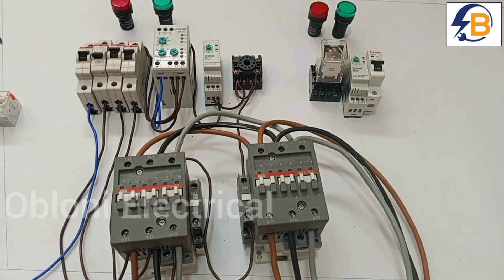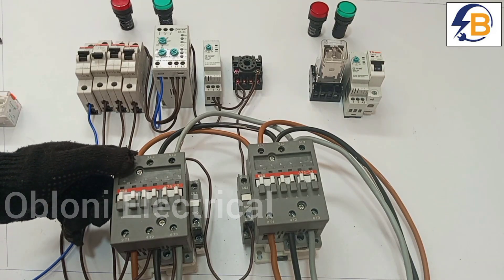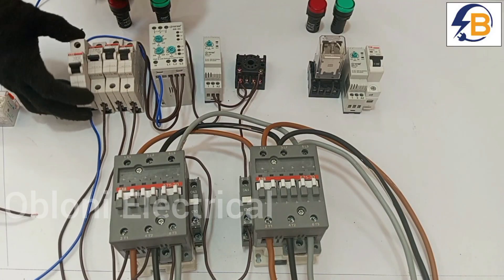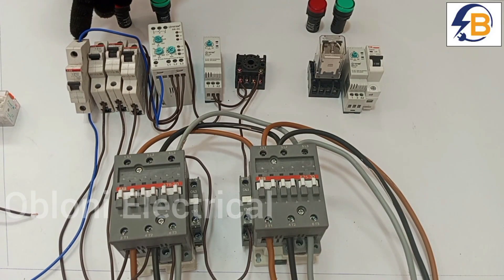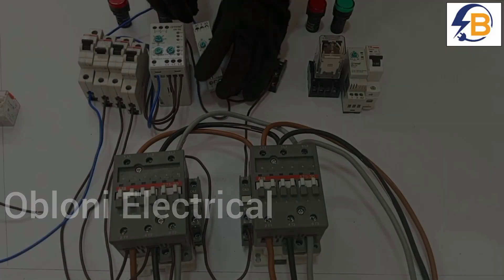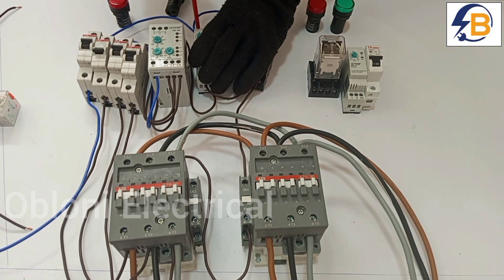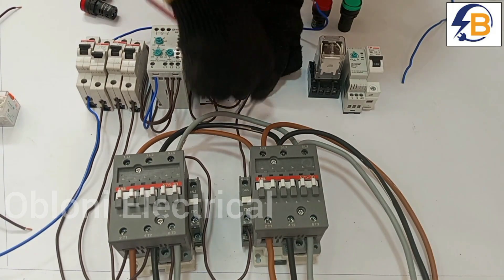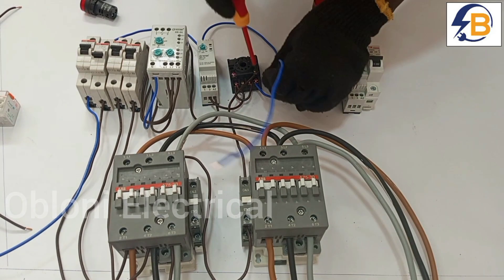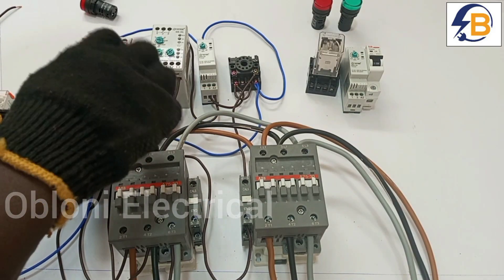The remaining thing to complete the control wiring for the main side is to connect neutral to the timer, neutral to the relay, and neutral to the second coil contact on the main contactor. We have our neutral output from this breaker, so we take the neutral to the timer from here and that goes to A1 on the timer. We take a loop from the same terminal and that goes to terminal 10 on the relay. Again we take a loop of the neutral from there and that goes straight to the remaining coil contact on the main contactor.